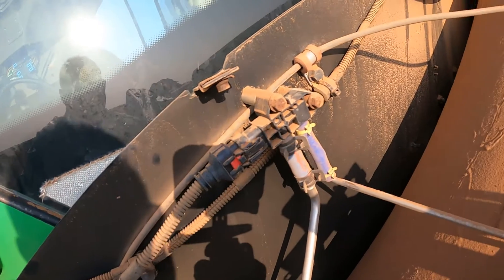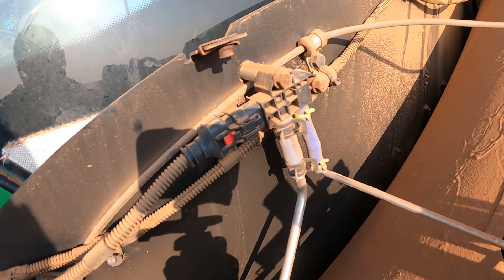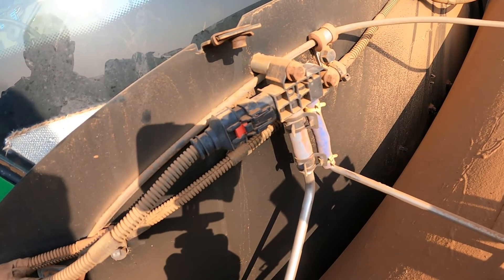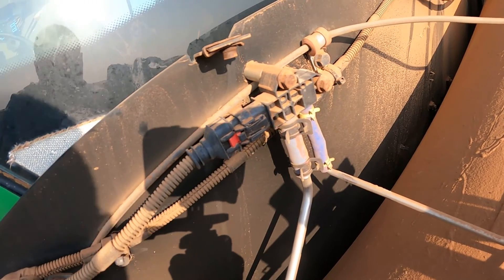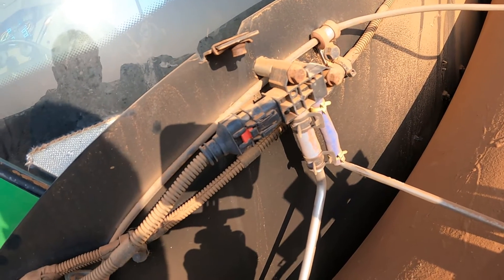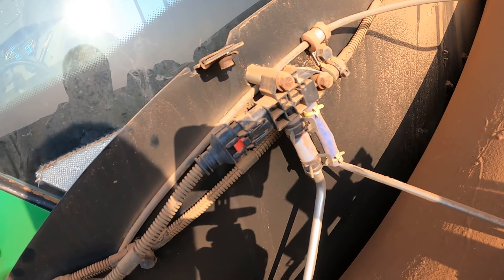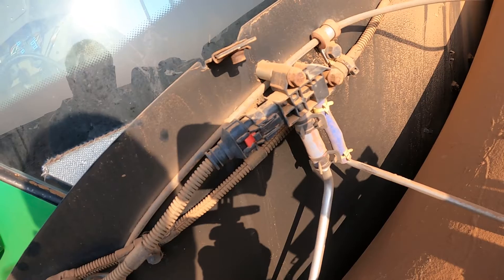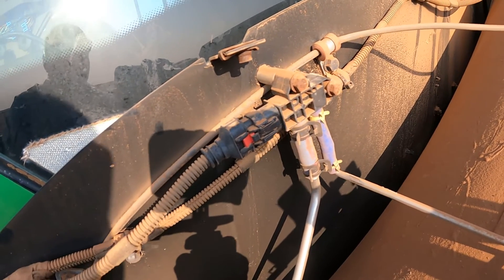One thing I've seen before is the little spout on the sensor — it's plastic where the hose connects — and I've seen those break off, which will also set that code. But what we have today is either a failed sensor, a lost five-volt power supply, or we're not getting a signal back to the ECU. There are about 12 steps to diagnose this problem.